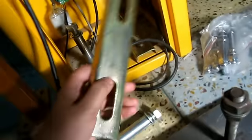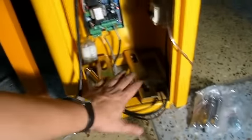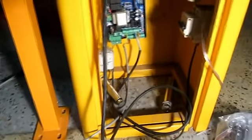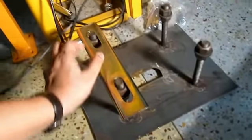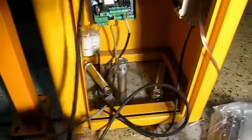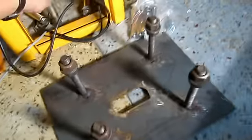You just connect this clamp and put the screw — this will be fixed on the base plate. The RCC structure should be 18 inches by 18 inches by 18 inches. If the RCC structure is not good, you can also have a base plate below the boom barrier and fix it with the clamp. So you can fix directly with the fastener on the RCC structure or use a properly mounted base plate.